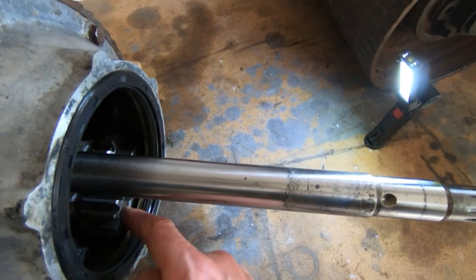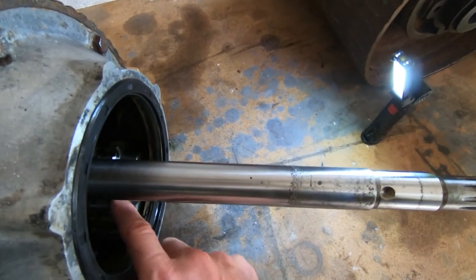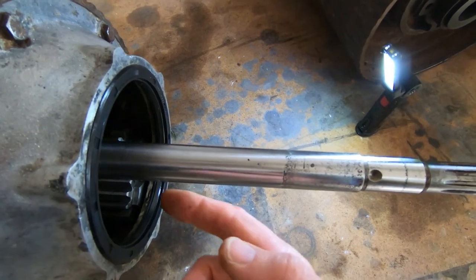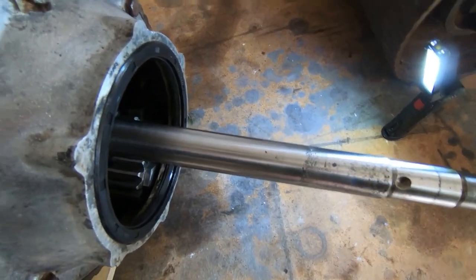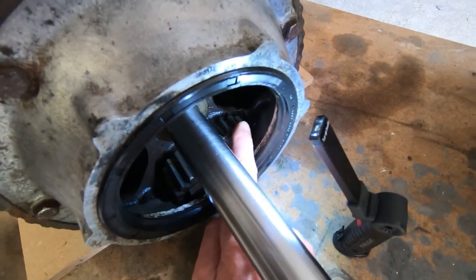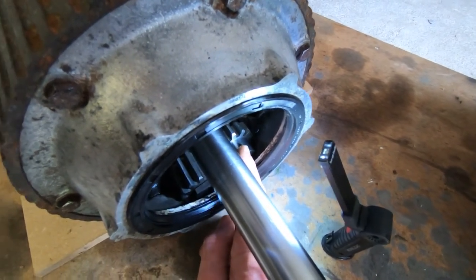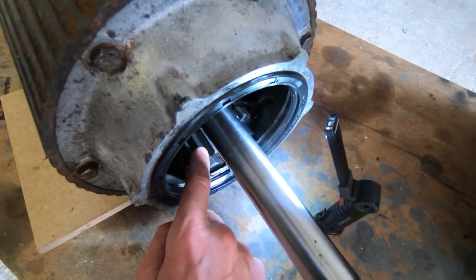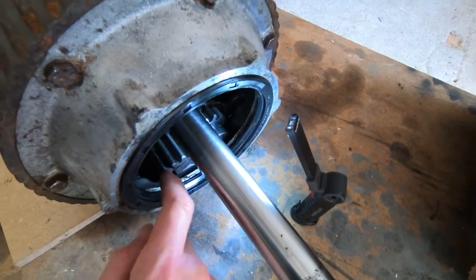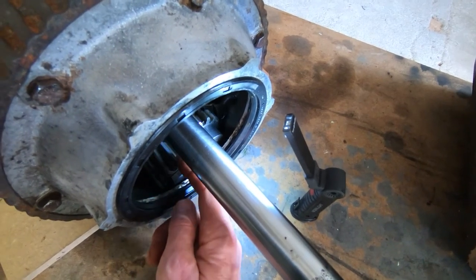But when you want to corner, they can turn relative to each other, so if you imagine turning this drum relative to this centre drum, then this would obviously rotate. And because it's on a shaft, it will rotate the shaft, but of course they need to rotate in opposite directions to allow you to corner. So on this end there are two gears that mesh with each other. They're the same gear that's on the other end, but it's fitted on this end in the opposite direction to give you clearance on the outside. It then meshes with this other wider gear, and the large gear on the drum meshes with the outer half of this gear, and so you get a single one-to-one gear ratio, but it reverses the direction of the rotation.